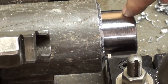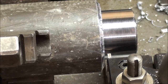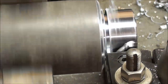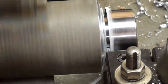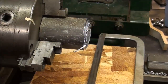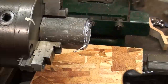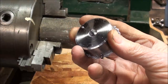Now here's the cutoff operation. It's going to be 3/4 inch thick, and I'm very leery about this thing grabbing, so I'll probably cut about halfway in and finish it off with a coarse hacksaw. That's as far as I'm going — I'll finish it with a hacksaw. That was a minute and a half to saw through, and the machine was not revolving, just standing still with a very coarse blade — looks like about 12 teeth per inch. However the finish is terrible, so I'll see what I can do about facing it off without leaving chuck marks.